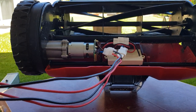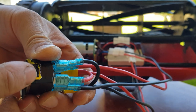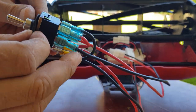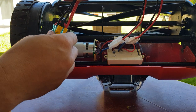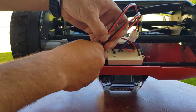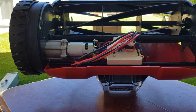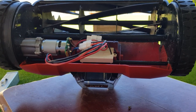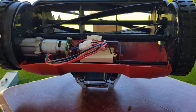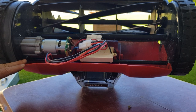So up to you if you want to leave it plugged or unplugged from these two. I'll just make sure I put this side - the marked one forward - so it actually corresponds with directions: forward will be mowing, backward will be back lapping. I'll take account of that when I install and fix it in my pre-drilled hole. The switch should be just sliding in there, just like that. It's not going to work like that - I'll have to pull the wheel apart and loosen some screws from here to give me a bit more clearance.